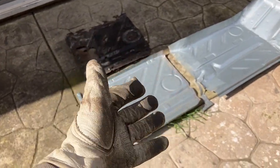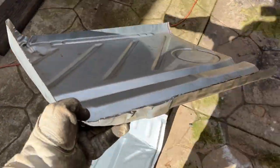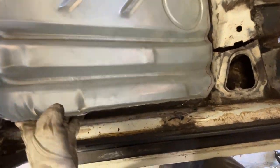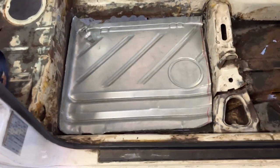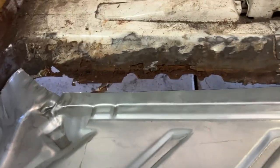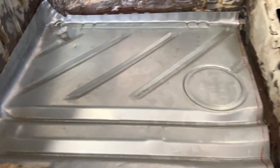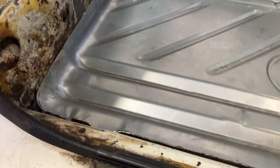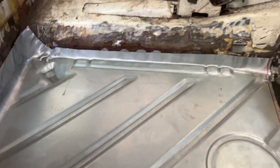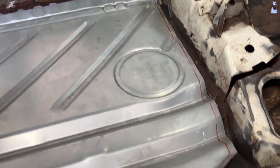This is time to wear your deerskin gloves — these edges are sharp and I didn't even deburr them yet. There's really no sense in deburring on the first cut because you're going to trim so much off that you'd spend your lifetime deburring. Just be careful with it. It doesn't fit that well — it's in there, but it's sitting a bit high. There's a gap we need to adjust, and quite a bit of adjusting to do. At least it's not for a Volvo or a Pinto — it's for a MK1 Rabbit, supposedly. I'm going to go to town cleaning out the edges and start trimming.